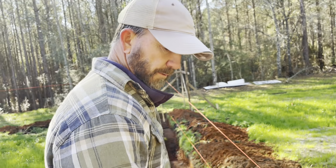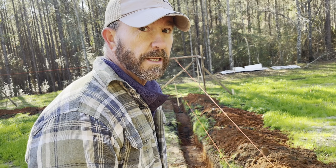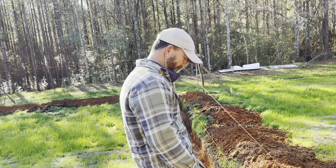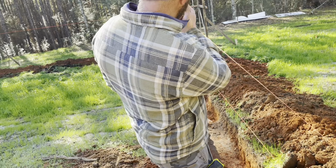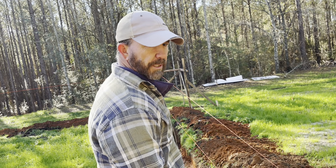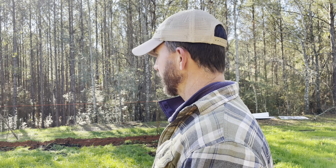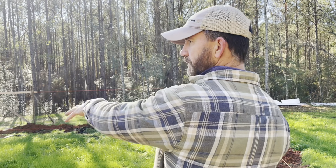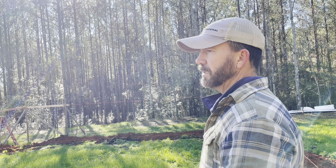It's not the easiest way, but if you saw me on a track hoe right now, you'd say why aren't you digging that by hand? Because it would probably be rough, and we'd be wasting concrete trying to fill up a hole that wide — I don't think I could keep it that straight and neat. Adding dirt and taking away, it's just better off to do it like this. So right now we're going to finish up the outside footers, dig the pillar footings inside, get all the rebar in, and get the step downs done for the concrete.